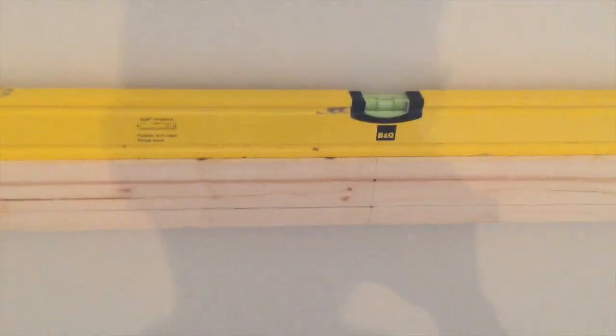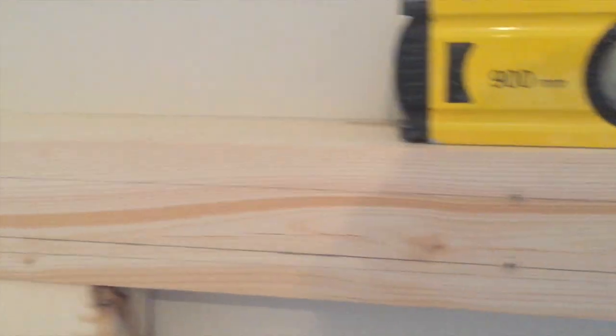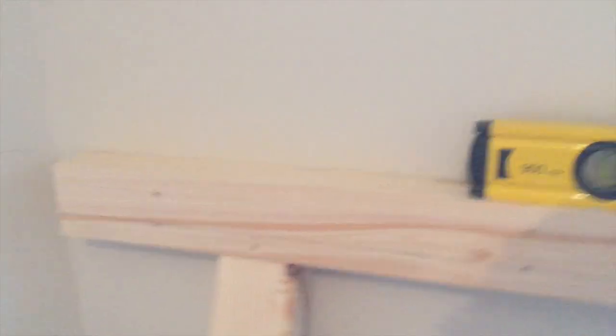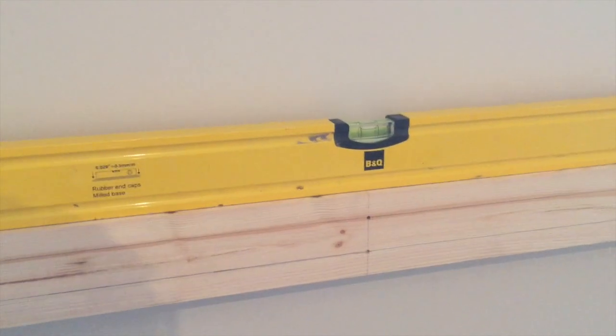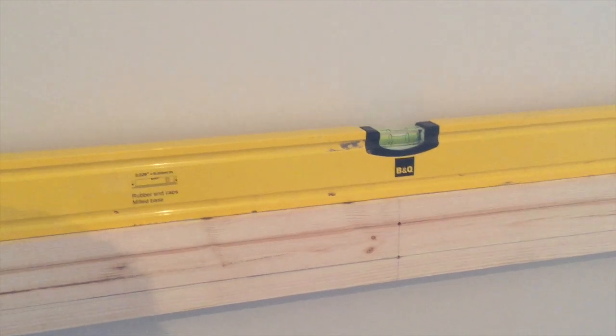While this piece is on the floor, I have also marked the wood on two lines. You can see these screw holes. I have drilled little pilot holes in the middle, then we'll do it again, and then 10 centimetres from the end, from exactly the same other side. So the idea now is to drill through, mark on the wall, drill the wall plug holes in the wall, and then attach the baton.